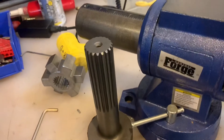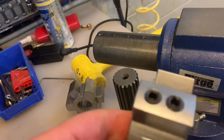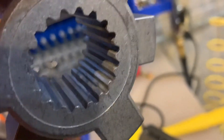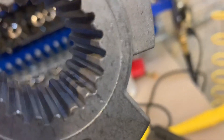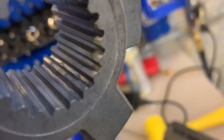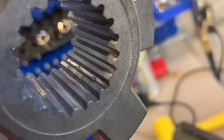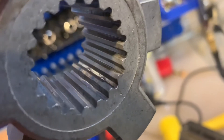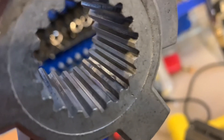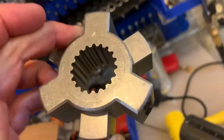As you can see, I have removed the hub from the shaft. Here we have the hub, and if it was torqued over the shaft you'll notice it did deform that material — you can see it right about there. That's why we say if you have to pull this off, you'll see some cracks inside — that's all intended because it's moved the material. Basically, if you ever remove this from the shaft it's one-time use and must be discarded. The material deforms on the spline and that's what grabs the shaft and keeps the hub fastened to the pump shaft.